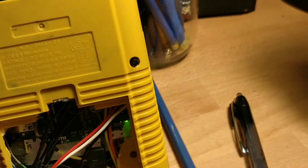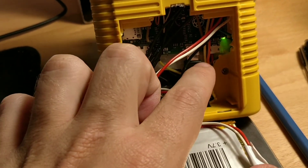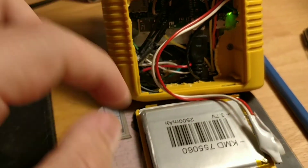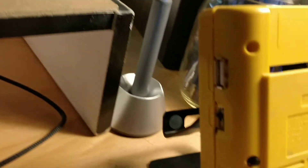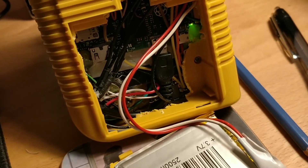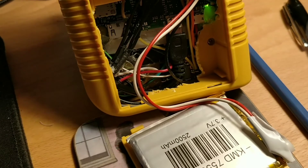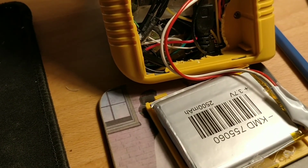Also, if you're doing this, I had also glued my Pi in before wiring it, so I have my micro USB just hacked together running up to a USB port. What I would recommend doing is before you do that, just solder the wires directly to the pads on there — then you don't have all this extra wasted bulk in there. Just a waste of space.